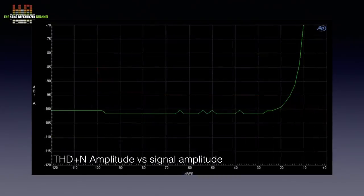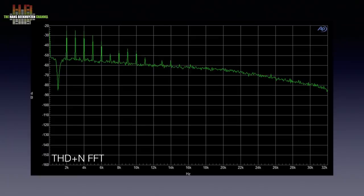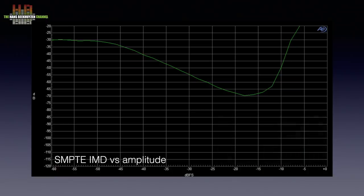When we look at the total harmonic distortion and noise versus amplitude, we see that the distortion is just below minus 100 dB for all levels below minus 20 dB, getting seriously higher from there upwards. This is exactly what I heard — measurement and listening outcomes confirm each other. The THD+N measurement shows a 1 kHz tone that is filtered out; it should show only noise like it does at higher frequencies, but here we see distortion products — tones, multiples of the 1 kHz stimulus added to the output due to distortion. The intermodulation distortion measurement is not very brilliant, and above minus 10 dB the distortion goes sky high.